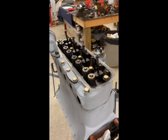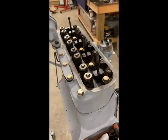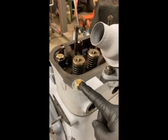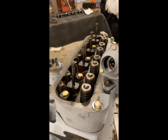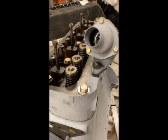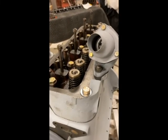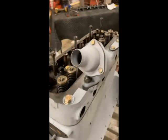I've got the push rods in place but haven't torqued the head yet. This front head bolt holds the bracket for my power steering, so I was going to wait, but in order to proceed with the rocker arm assembly I need that center line torqued. I'll go ahead and torque the whole head — this one bolt will be the only one I'll need to remove later when I mount up the power steering bracketry.